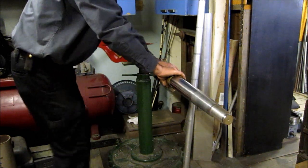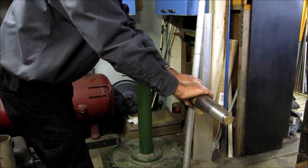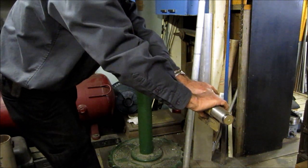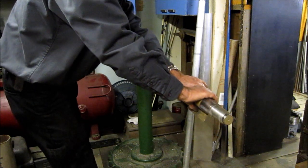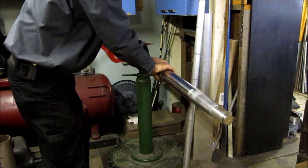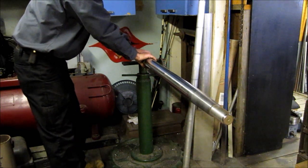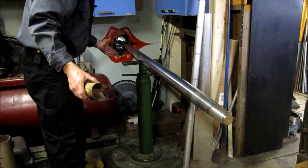This shaft is turning 450 RPM right now, and you can see what I mean about the lubrication on that felt-rim pad — it comes nice and smooth. When you've got a true running, smooth running shaft, you don't take much to hold it in line.